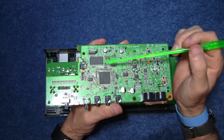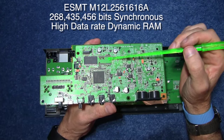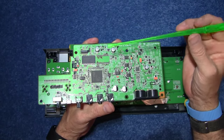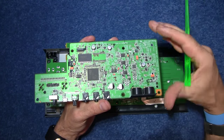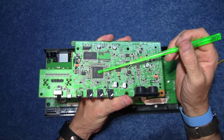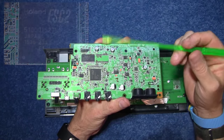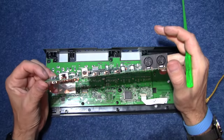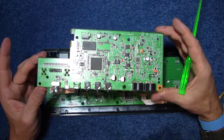I can see immediately that it's got the ESMT memory — Elite Semiconductor Memory Technology — and it looks like they could have put a second one on but decided not to. This board might not be the same in all three boutiques, but mind you I don't see why not, because all they have to do is program this FPGA chip to do everything. The FPGA chip — the ESC2 — is in all of the Roland products, and this is where all the Analog Circuit Behaviour, ACB, is computed. So I wonder if this is actually the same board in all three of them — it would be interesting.